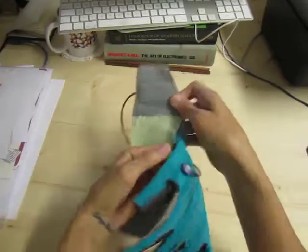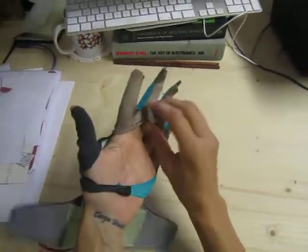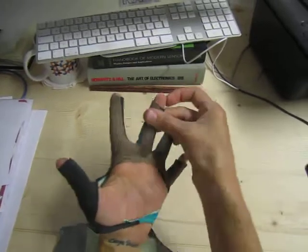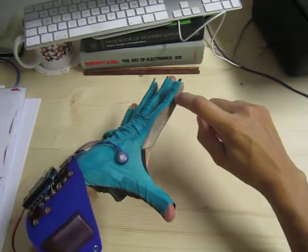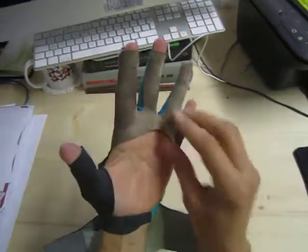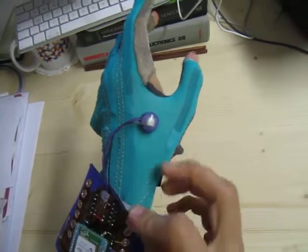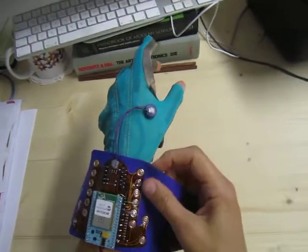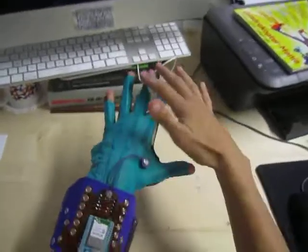So I can put on the glove — the ground plane for all of the e-textile sensors is this piece of conductive fabric here on the palm. And there's a conductive thread stitched along here to bring that ground along the thumb. All the conductive threads are stitched to snaps on the lower material, on the stretchy power mesh. And then the snaps on the breakout board are directly connected through the neoprene, so the wristband can be separate from the glove.